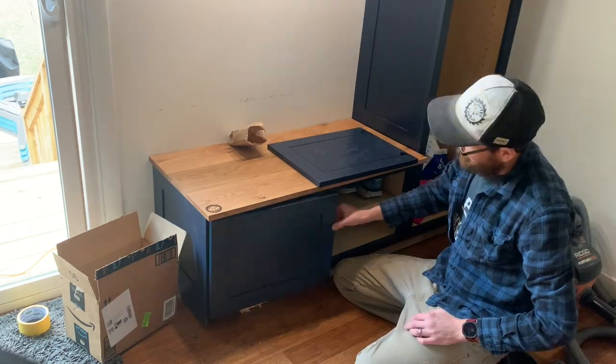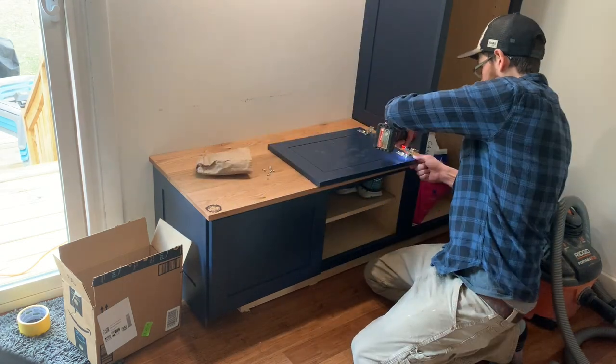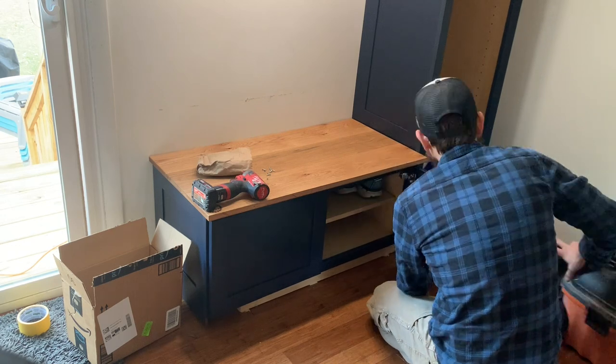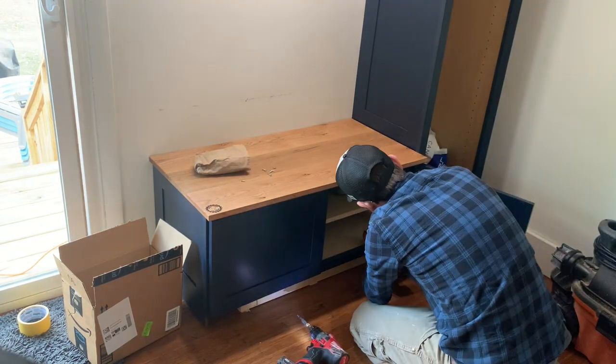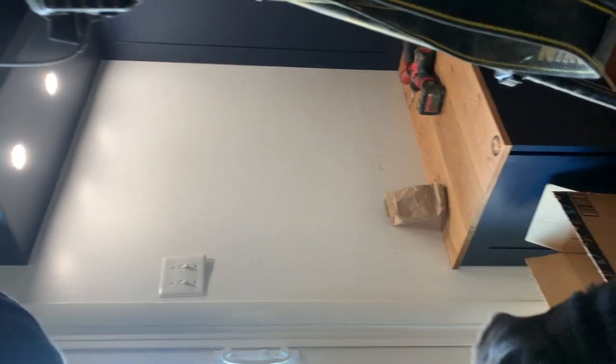Not that our shoes are ugly, but the doors just hide the mess and give it that really complete look. So we put the doors on there with the Blum soft close hinges with an inch and a quarter overlay for very, very tight reveals. I think the hallmark of good cabinetry is tighter and tighter reveals. And this project at home would not be complete without a little extra help from all of the kids — we had Lionel first, then Joey second, and now Emerson is going to help me film.